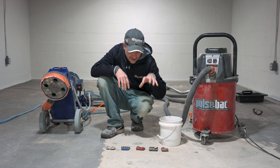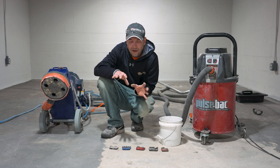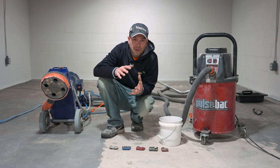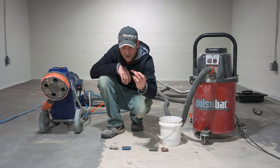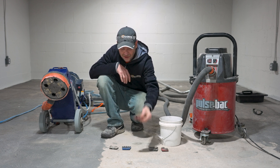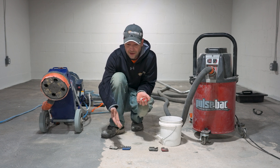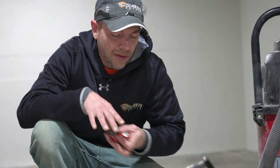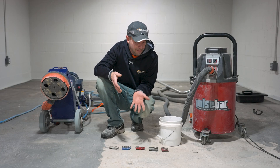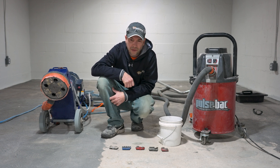Those are going to be the main things you're going to use to grind concrete. Just to wrap up — it's so important to know what your end product needs to look like. If I was going to run over this entire floor and clean it up with buttons, I'd just be wasting my time. But if I'm going to do a dye and seal system or even metallic epoxy, I might want to smooth things up a bit. It's tough in the beginning because you'll have to buy a bunch of sets of diamonds, but once you develop an arsenal, just find the one that works.